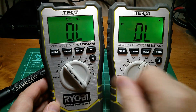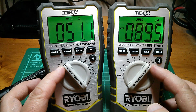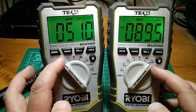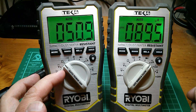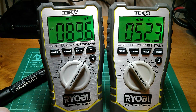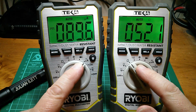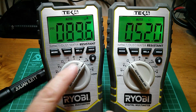What about measuring the resistance of the current measuring ranges? The resistance of this meter when it's in microamps is 51 ohms. And in order to measure that 51 ohms, the current flowing through this meter is 89.5 microamps. Is that consistent when switched the other way - ohms and microamps? Yes, it's completely consistent. The input resistance of this meter when measuring microamps is 52 ohms, and a current of 89.6 microamps flows.